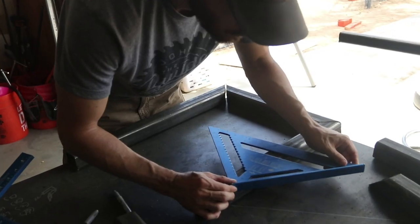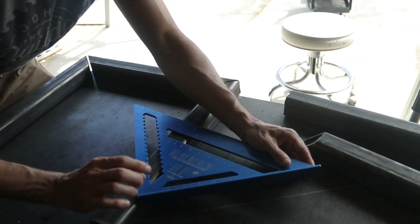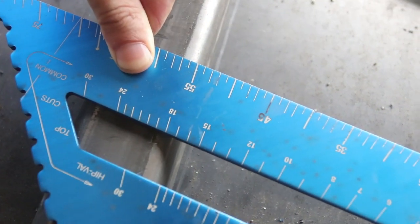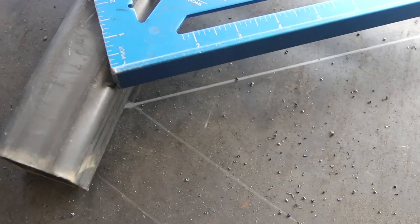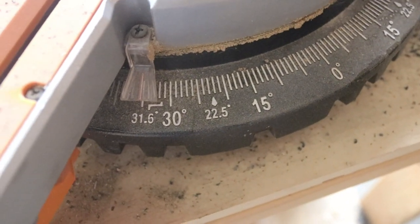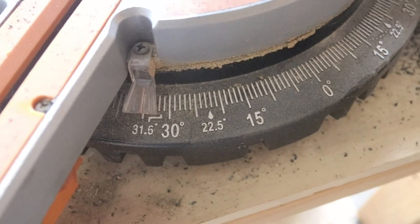I lay out all my lines and then just match the saw to it. I enlisted the help of Brad to find the angle I'm looking for on the back. He's using a carpenter square and on the pivot point, he's lining it up to tell us where we need the angle to be, which is 55 degrees for a 110-degree angle. Set the saw to 35 degrees and that will give us the angle we're looking for, because 35 is the difference between 90 and 55.